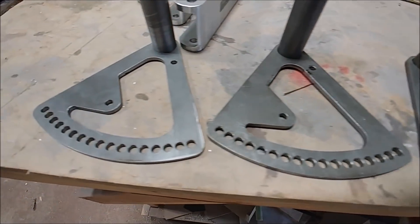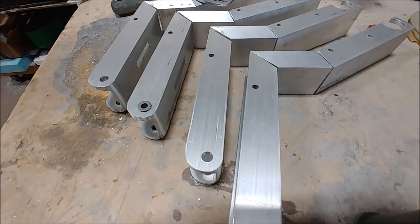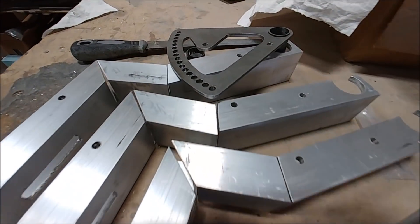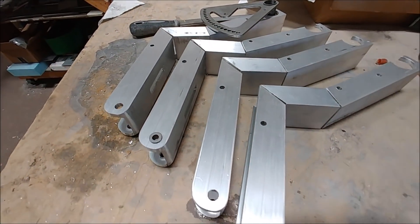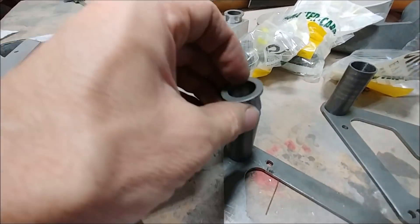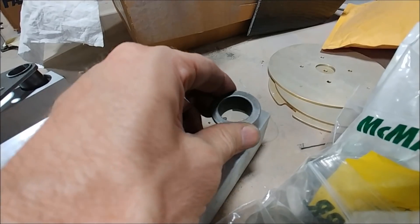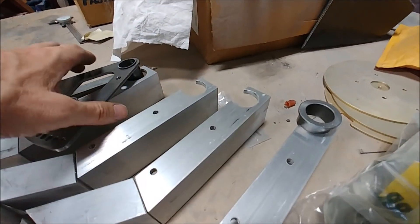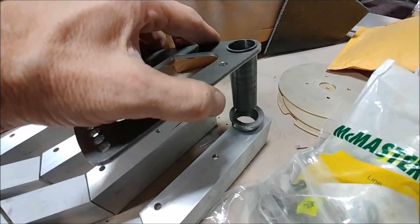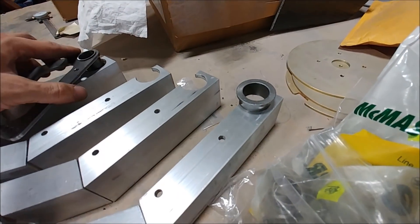Here's a summary of what I did over the last three days. There are the four quadrants, and the four pedals all laid out, drilled and trimmed — one of them has bushings in the bottom, so they're ready to be welded up. These are the bushings I ordered from McMaster. We were going to use iglides but decided to use oil bushings instead — much better fit, more accurate. Basically the quadrant goes through there through that bushing, and you'll see it all come together probably over the next week or so once I get this stuff welded up.